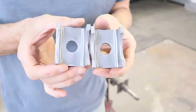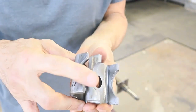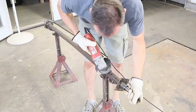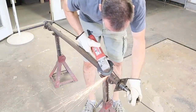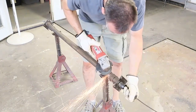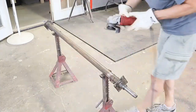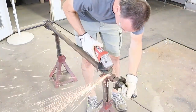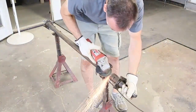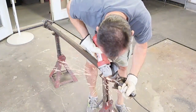I'm going to put a flip kit on it. I beveled the edges of the part that's going to go up against the axle tube, then I lightly grind the axle tube to get bare metal so that the weld will be able to bond the new spring perch better. Keep in mind I'm showing you one side of everything — whatever I do on one side you have to do again on the other side.